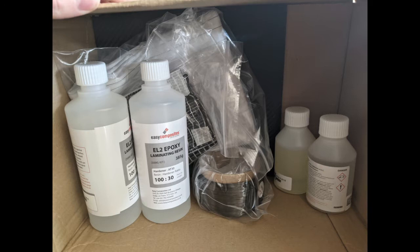The reason for the slow and fast cure resin is that the working life can change quite a bit as well as the cure time for different hardeners. Slow cure gives you a longer working time but takes much longer to harden. The slower cures tend to be stronger, so it's better to use the slow cure when you can. Unfortunately I spent too long in the design phase and didn't leave myself enough time for all the cure cycles, but some assembly jobs were quite fiddly so I'd need a long pot life — I knew I needed to speed things up somehow.